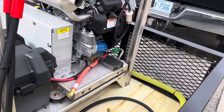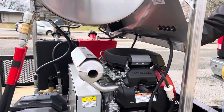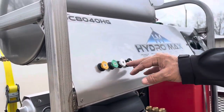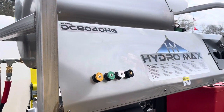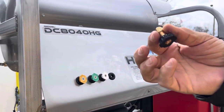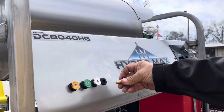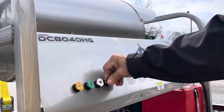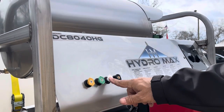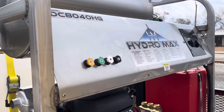Right here is a drain for the engine. These nozzles here are 4,000 PSI nozzles — used when you're only operating one wand. The black ones on either wand are for soap. And these just have different spray patterns. So have fun with it.